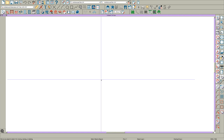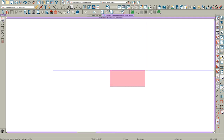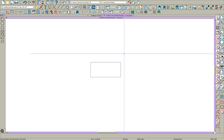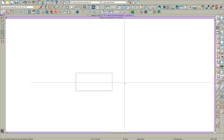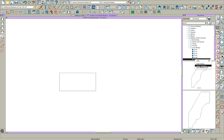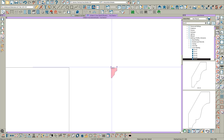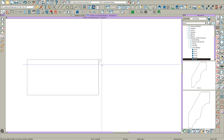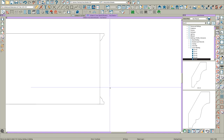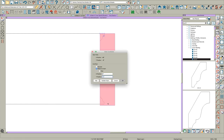The first thing I'm going to do is draw this in elevation, so I'm going to use a back clip cross-section view. I'm going to draw a polyline — something say 36 by 16 — and I'm going to turn my snap grids off. I'll make the base first, then open the library and find my molding: CA21, show in browser, right click, place molding profile, and pull the back square, go point to point and move it to here. Then I'm going to copy and reflect about this molding, then do another polyline and draw it say 4 by minus 16.